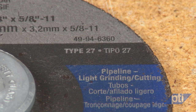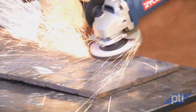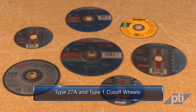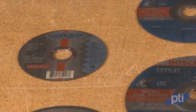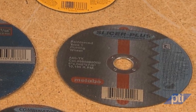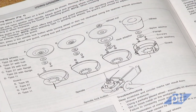The most common are Type 27 grinding wheels, which are straight outside the center depressed zone, and Type 28 grinding wheels, which are saucer-shaped outside of the center depressed area. These grinding wheels were designed to remove material with the bottom face and occasionally with the perimeter of the wheel. A Type 27A cutoff wheel, which is straight outside the center depressed zone, is designed to work only with the edge of the wheel — the top or bottom face must never be used for grinding. Cutoff wheels are also available as a Type 1 cutting wheel, which is a straight wheel. There are also tapered cup wheels for surface grinding called Type 11. Always consult the tool manufacturer's instructions to verify what types of accessories your grinder was designed for, since appropriate guards and wheel mounting hardware must be used.